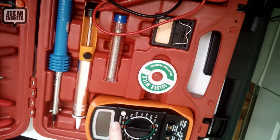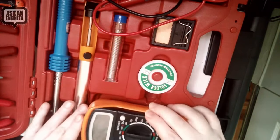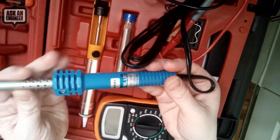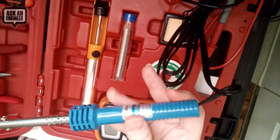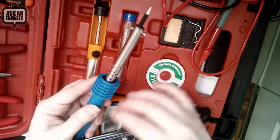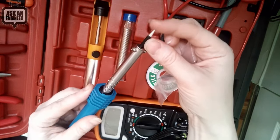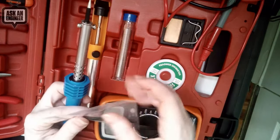There's also soldering equipment. They've got a Hakko blue 40-watt, 120-volt iron. It's a lower cost iron — it doesn't have adjustable temperature controls — but it's going to be lead-free since Hakko makes lead-free stuff. You can change the tip out and they give you an extra tip, which I think is really nice. The tip is good for heavy SMT components like SOICs, 1206s, 0805s. You could probably do 0603s and definitely through-hole.